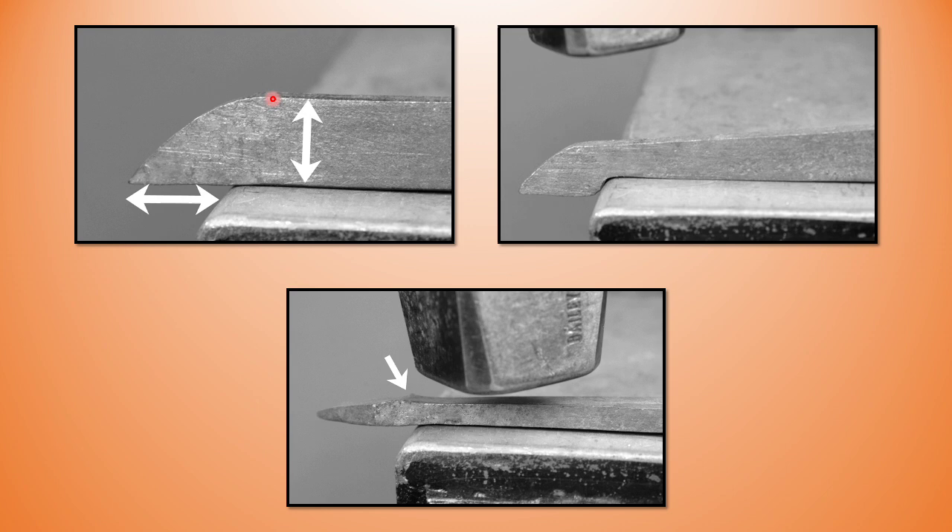From there, I lay off as much of the bar as the bar is wide — we're dealing with three-quarters of an inch — so I lay off three-quarters of an inch. It doesn't matter if your taper rests on the anvil because it's going to get forged anyway, as you can see in that top right photograph. Just lay off as much of the bar as the bar is wide, then neck it down to leave three-eighths of an inch of material — half of the bar thickness. Extend that taper back to your five and a half inch mark already center punched.